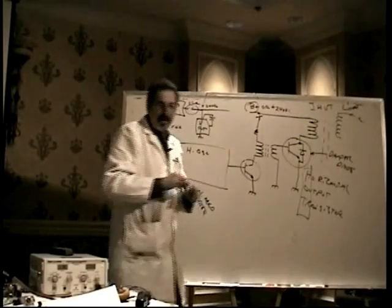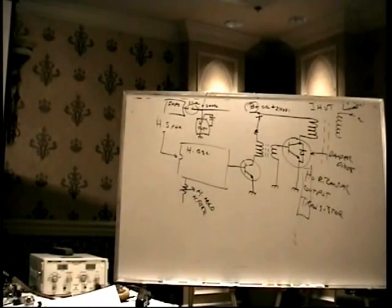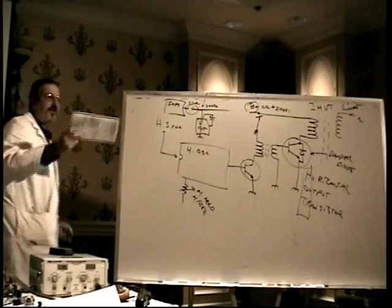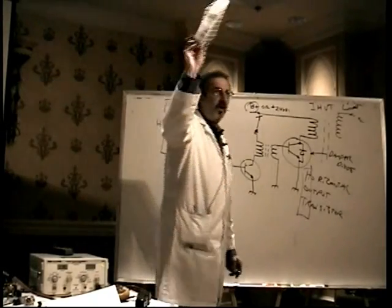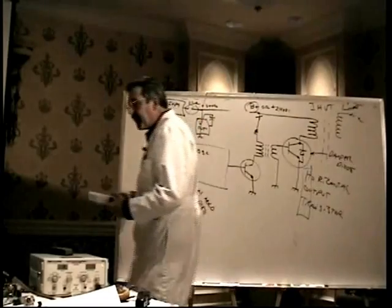If the transistor that came out has a damper diode in it, the transistor that goes back has to have a damper diode in it. That's really, really important. I never go nowhere without horizontal output transistors. This box is full of them. Horizontal output transistors, extremely common failure.